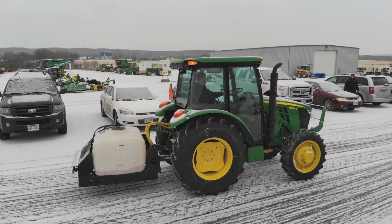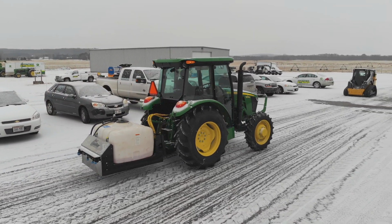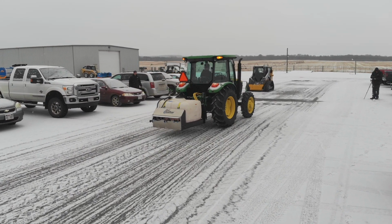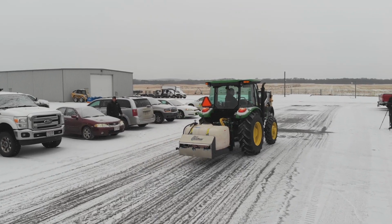Which gets us to another topic of wanting to calibrate everything. Now this is just like a salt spreader, you don't want to be doing too much or too little, you want to find that ideal amount, and calibrating what your nozzles, your sprayer, and your setup does is a huge part of it. The best way to do this is take a timer, take a 5-gallon or 1-gallon bucket or something like that, turn on your pump, your hydraulics, however you've got it connected, and then run the timer on it, and then calculate how many gallons per minute, what's your GPM from there. Then you can go into how many gallons per 1,000 square feet, do the math of how long it would take to do that area, what you're spreading per 1,000 square feet per minute, and figure out what speed you need to be going, how wide the angle of your nozzles can spread, and if you need to slow down your pressures or speed up, things like that.